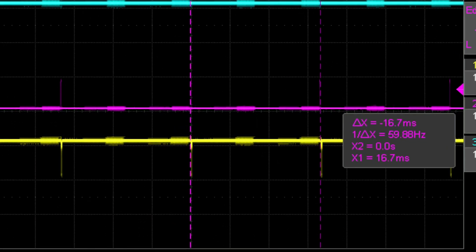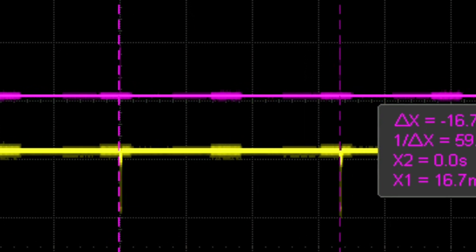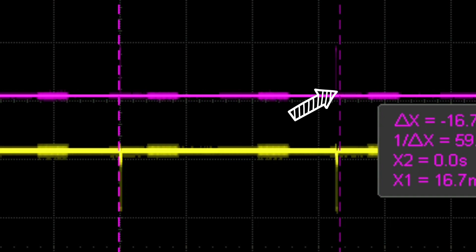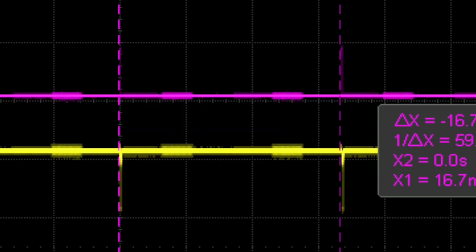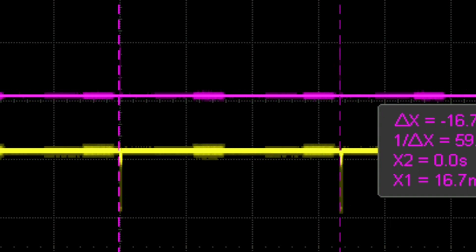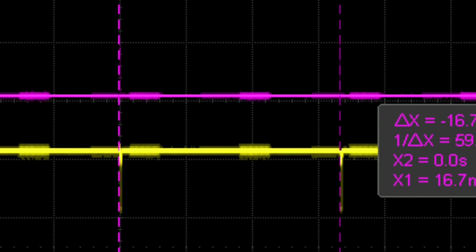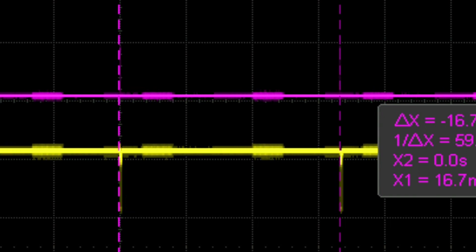And you can see that here. The oscilloscope is set up to trigger, or basically align with this first pulse here. And if you look closely at the pulse that follows, you can kind of see it wiggling around like Electro Boom's eyebrows. This is indicating that the timing is slightly inconsistent. So what we're seeing are slight inconsistencies in how often the NES queries the controller state. In the initial build, we built it around the idea that it was consistent, or at least that it was consistent enough. Well, consistent enough, it was not.